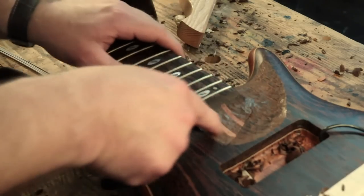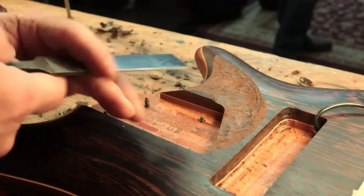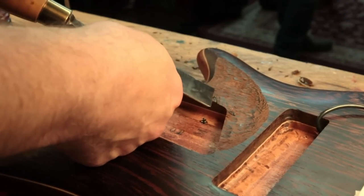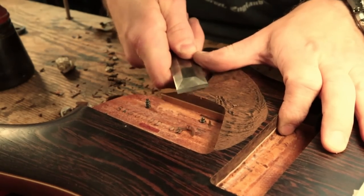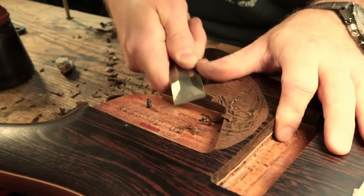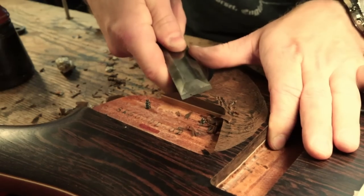There we go. Neck out. Tidy up that shape there, and we're done. Okay, there we go. So there's that. Just don't like how tall that lump is there. I don't like pushing against an open cavity just in case it shatters there, but I also have a nicely sharp chisel. So go down to the height I want at a slight angle. And it's not too dangerous.